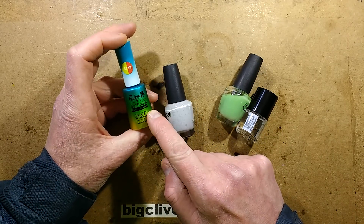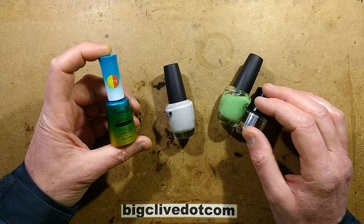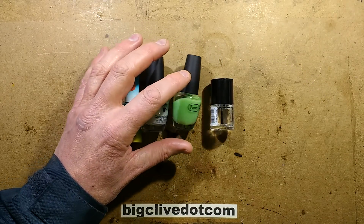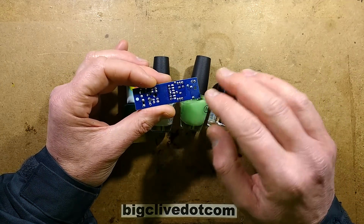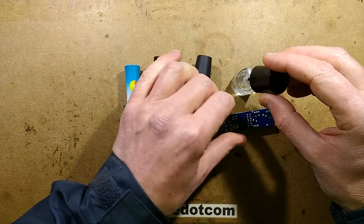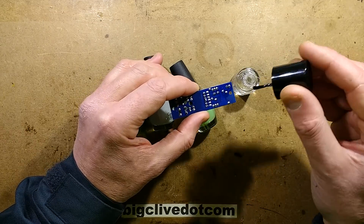In a recent video I mentioned this colour-changing nail polish. It's basically temperature sensitive, for ladies who want their nails to change colour. But there are other lacquers from the nail polish range that are quite useful. This clear one is one of the most useful - if you've got a circuit board that's prone to tracking between connections because of a modestly high voltage, an easy fix is to clean the circuit board and apply a clear nail lacquer, painting over that area to provide a localised tropicalized lacquer.